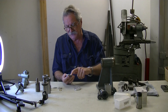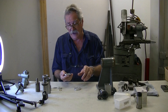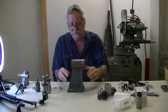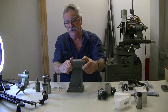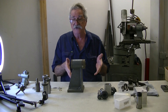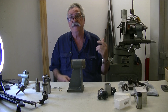Flanges — I prefer to make something substantial. While you're making the flange, just put a little bit of a dish on the inside. If you don't put a dish in, you'll find that they'll wear on the outer edge and the wheels won't be supported. Aluminium is quite a good material for bushes. Here is the work head — just a weldment, absolutely dead easy, with a bronze bush that turns inside it on a 25mm shaft. It's well made and robust. After I finish here I'll take you up onto the Clarkson and you can have a look at the factory-made work head — that's a fairly simple item as well.